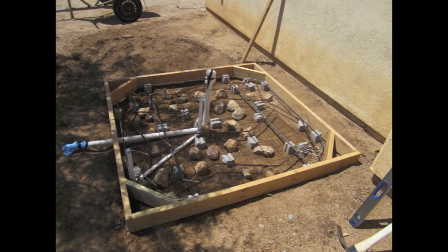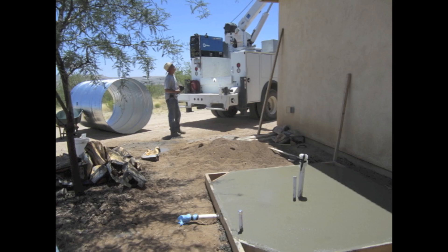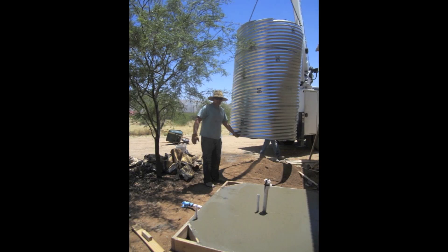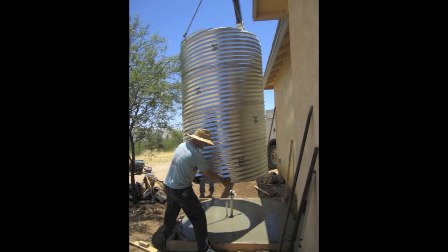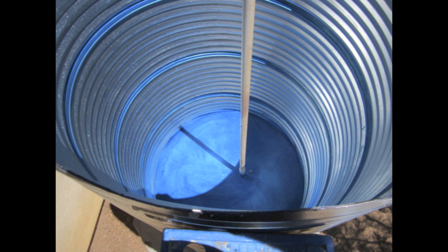The foundation was composed of 2x8s and scrap rebar. I dug down the center so that I would have a slab of approximately 10 inches, set my PVC, and then poured in a soupy mix of concrete. My father-in-law Les was nice enough to help with the entire process, as well as lend his work truck to help move the culvert into place. But if you don't have access to a truck, four reasonably strong friends, 2x4s, and some strapping can also move one of these culverts, as seen in my video where I helped my friend Jason install one. Once the concrete was fully cured, I finished it out with some liquid rubber on the inside seams and the bottom.